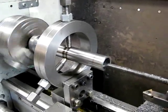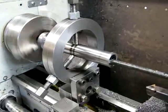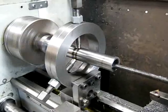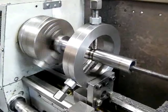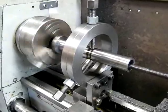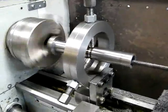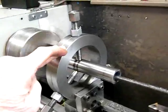Here's a bit of a follow up to the video I did yesterday on the fixed steady that I showed you. As I said, you don't use them very often, but whenever you've got a job that won't go through the spindle and it's hanging outboard like this, you basically have to have a fixed steady otherwise you can't work on it. So here she is.